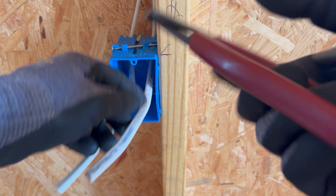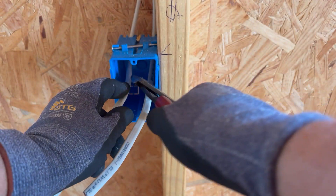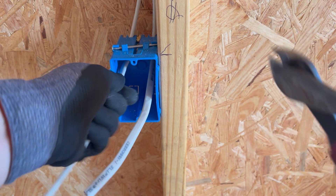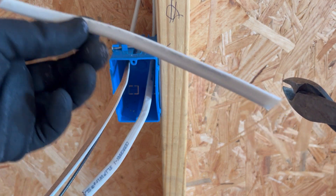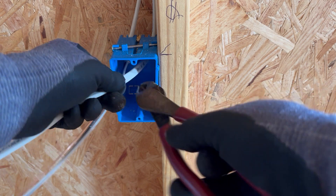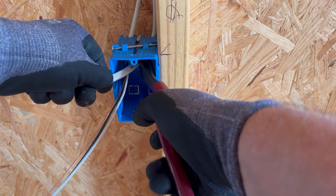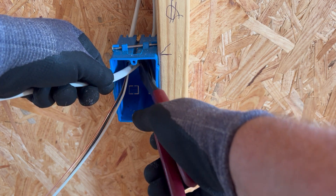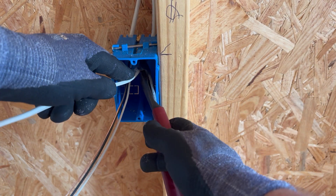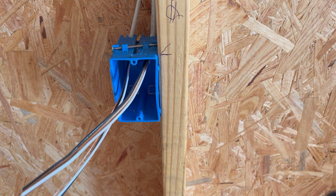I've shown this before in some other videos. You can cut the insulation off — you want to leave some insulation in the box. You can take your dykes way in the back of the box and give a little bit of a squeeze on the insulation. But don't squeeze too hard — you just want to score the insulation so it comes off. You don't want to nick the wires, because if you nick the wires you can take a chunk out of the copper and it's no good. You'd need to pull another one. Just give it a little bit of a pinch — not much, don't pinch it hard. The goal is just to score the insulation so it comes off. I did it so little it wasn't even enough, which is okay because I don't want to damage the wiring. Otherwise we're pulling new wires after drywall, and that's going to be a real pain.